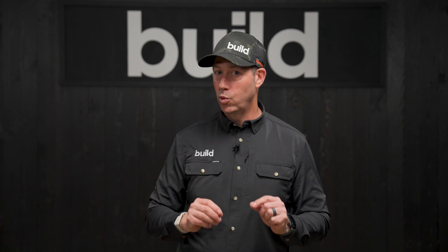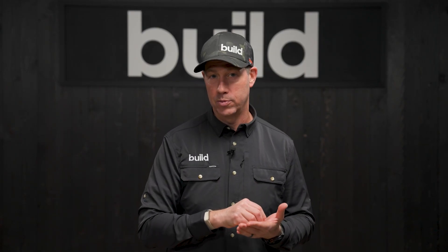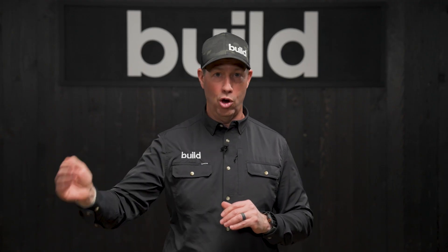On The Build Show today, I want to test some modern house wraps to see if lumber could dry through them. We should also be thinking about owning a moisture meter and double-checking. If our house gets wet, it can absolutely dry without problems. But before we move on in construction, we really should verify that all of our lumber is below 14% moisture content. That's real important. Today, we're testing house wraps to see how well a wet 2x4 will dry through. Let's get going.